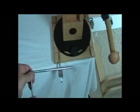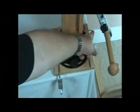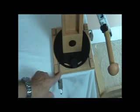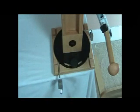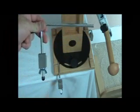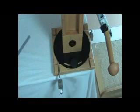In this case I've mounted the second bolt, as you can see, on the back side, because I'm on the corner of the table, and I can do that. By doing that, I've made it really secure. But normally you would put it on the front two slots on a regular installation. You can see that bolt is 7 inches across by about 5, I believe, and it's 5/16 inches in diameter, so it's extremely strong.